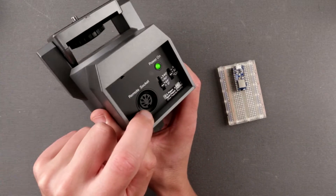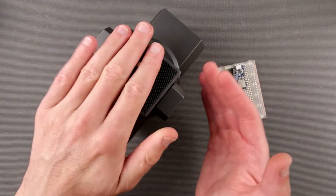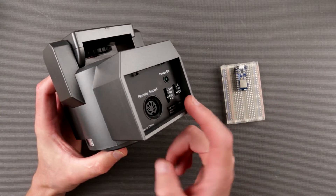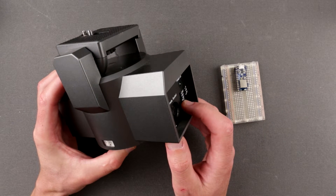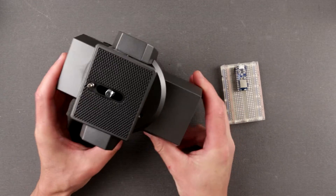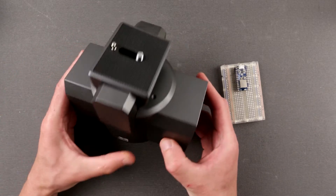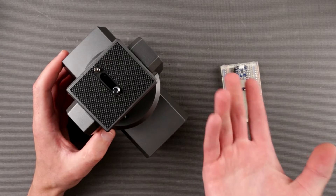In manual mode you can control it with a remote socket. It can do pan and tilt — this base is tilting, so you can connect your camera and control it. What I've done is inserted a microcontroller in here. You can check my old video — the microcontroller was based on Arduino Uno, essentially a 328 microcontroller with a simple serial Bluetooth chip. I wrote a little program which sends serial commands over Bluetooth. I was actually using this thing to take pictures remotely, for example not to disturb birds and animals. It was really, really useful.